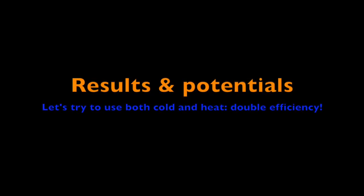Now the results and possibilities. As you will see later in this video, I'm not quite ready, but I'm building a prototype. The results are that the cellar temperature drops and the fruit lasts longer, even if it's not at the ideal temperature of 0 to 3 degrees Celsius — for example, because you want to use only excess energy from the photovoltaic panels. The other result is that you have stored heat in water, which can be reused for domestic hot water, washing fruit, or heating a space. This principle works beyond pears — you can use it for vegetables, wine, and even cooling living spaces.